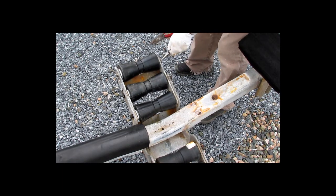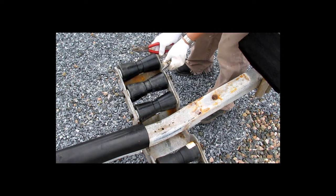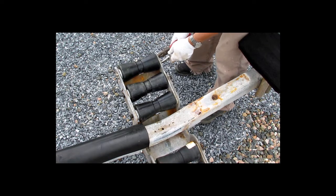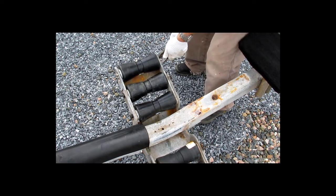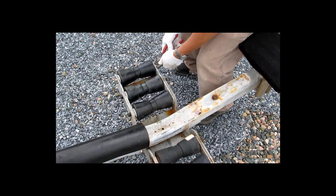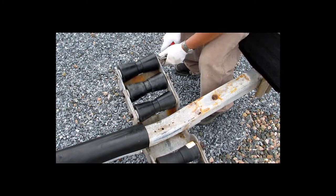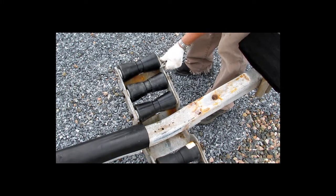We're just reinstalling the cotter pins on the other side and bending one arm of them down to prevent the shaft from sliding out. You may require two pairs of pliers to hold it because the rollers want to roll, and it makes it difficult to bend the other part of the cotter pin down. You could also use a pair of vice grips on the other end of the shaft to hold it from rotating as well.